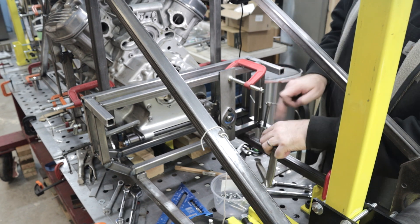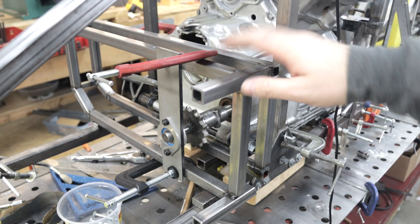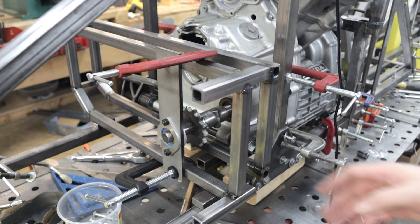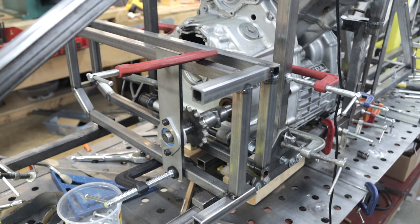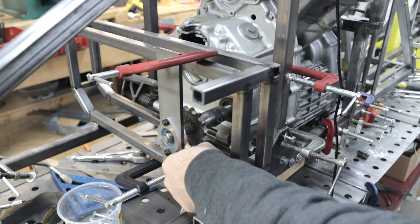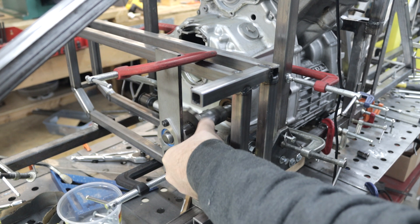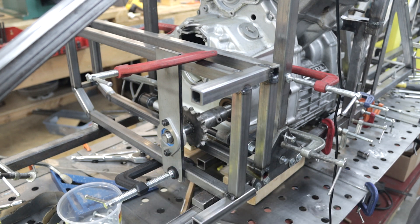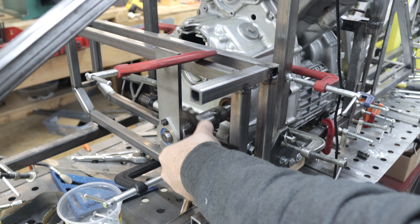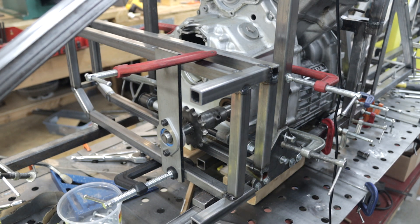It was looking pretty good at first, but then the first big problem would reveal itself. The engine reduction cage came out pretty good, but fit testing it in the frame with the test engine — which is just a hollow engine but does have the output shaft properly bearing mounted — if you rotate the part you can see that it drags the engine cage all over the place. The motion is visible. This will be rubber mounted, but that means the engine is doing a lot of work just fighting against these rubber mounts. So I need to get this thing square. This was fabricated years ago by another person, and it seems to have about 50-60 thousandths run out. So I need to figure out what to do with that.